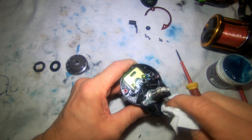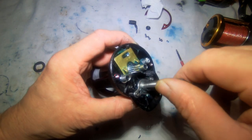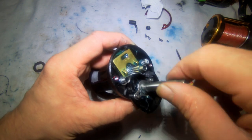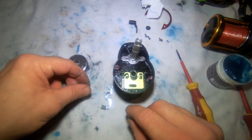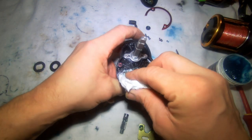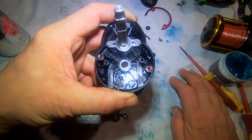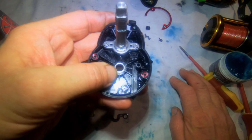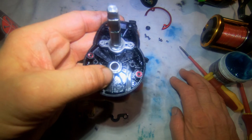Take any excess grease off that. That's just for your handle — that's why we grease that one and don't oil it, so it stays moving all the time. Last thing to do on the rail: remove the two springs, move the pinion, take the plate away, clean the excess grease off here. You can see your pinion bearing inside the plate — I wouldn't remove these unless they're broken; you just bang them out and bang them back in. There's nothing wrong with it so we'll just give it a clean out and a little bit of oil on there.